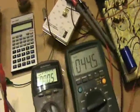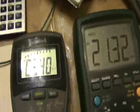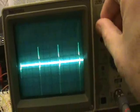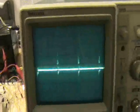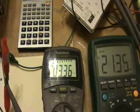What I wanted to show is if I increase the load — we have about a 3 milliamp output here. You can see the ring goes away because we have a lower resistance as a load. Watch what happens when I crank this up — you can see the edge of this pulse. Watch what happens as I increase the load, meaning I make the load go back towards infinity in terms of resistance.